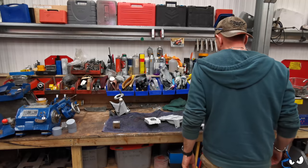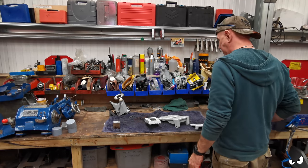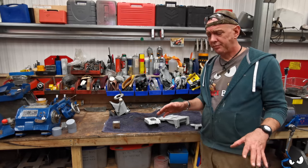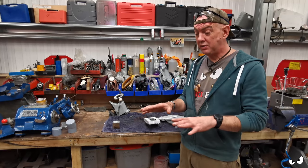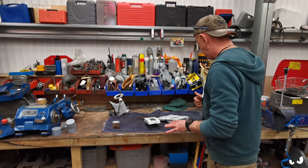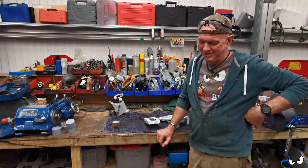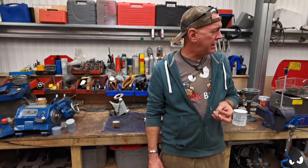Right, so just giving these a little coat of paint. It's the second coat, slapped it on with a brush, I ain't bothered. Everything sits on the bed on this machine. So as far as leveling it out and everything else, as long as everything is true to the ways, then we're sorted. Somebody did drop a comment about, make sure you level it. Well, I know it's good practice, and I've got it near enough level. The floor ain't that bad, neither's the cabinet.